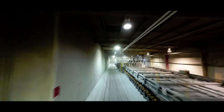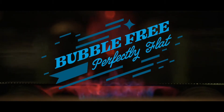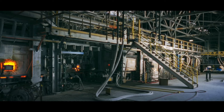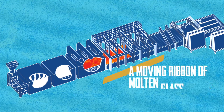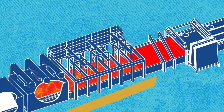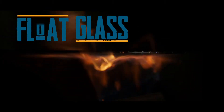To make glass worth looking through, the finished product must have two very important features: it must be bubble-free and perfectly flat. And to make perfectly flat glass, you need a perfectly flat surface — that's where tin comes in. Flat panes of glass are formed by pouring the molten mixture on top of a river of melted tin. The density of the tin allows the glass to float on top, while the undisturbed surface of the liquid tin creates a flawlessly flat surface, which is why this process is referred to as float glass.